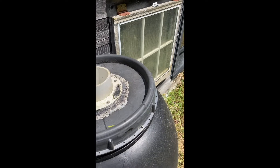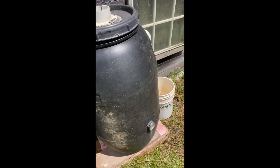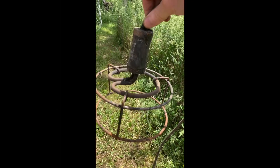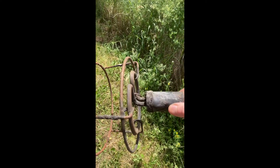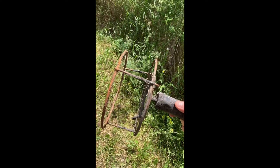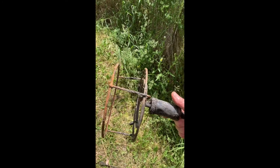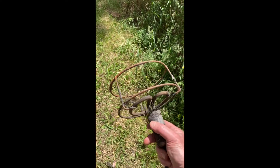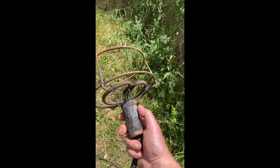Let's talk about heat — this is going to need some heat. We need to maintain about 100 degrees, which may work fine in the summertime and not so well when it's colder. This submersible stock tank heater is a great option. The only issue is that most of them have thermostatic controls inside. If it's above 40 degrees the heater turns off. I found one that offered a wider temperature range, or I cut this open, disconnected the thermostat, and bypassed it altogether.